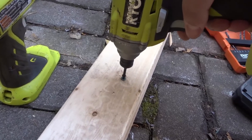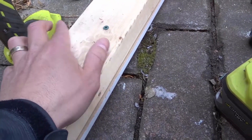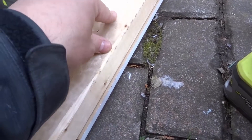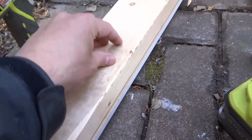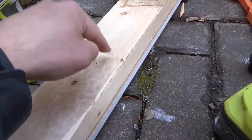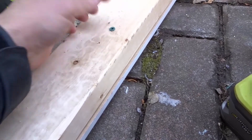Then I'm just going to drive the screw down just like that. As you can see, it allowed me to fasten the screw into the material — it didn't tear anything, it looks amazing, it responded really well, and it made sure the screw is nice and straight. The screw is going to be more secure in there because it is nice and snug, whereas if you don't have a pilot hole the screw is tearing up that material and may be damaging the material around it. By having a pilot hole you're less likely to crack the material and more likely to have a nice and secure screw fastened in place.